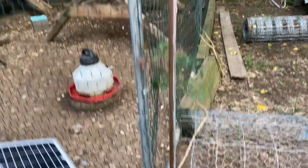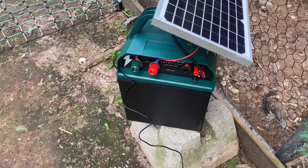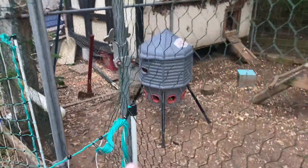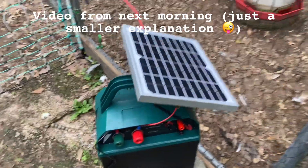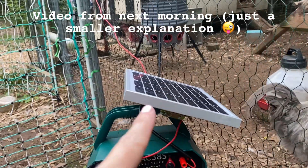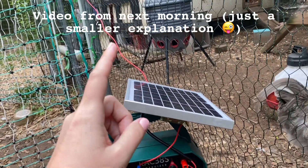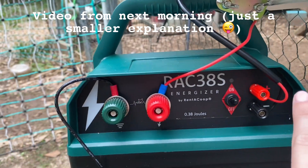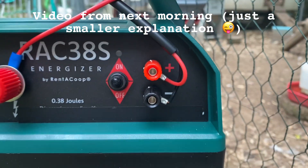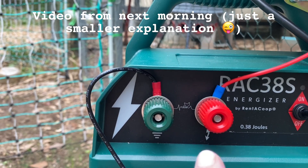There's our grounding rod - it's tall but we're gonna chop it down. There's the solar panel and there's a battery inside of it. It's hooked up and connected onto our fencing right there, but this did not become hot - which is good. This is how we have it hooked up. You'll hook up the solar panel; they say it needs to face either north or south so it can catch the sun going from east to west. This one is pointed north for us. You'll attach your wires like this.